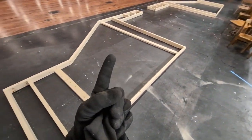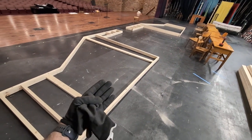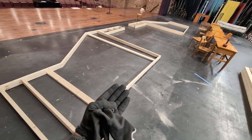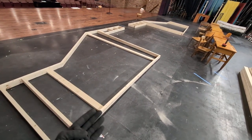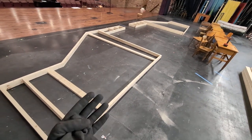The thing about it being, you want to get it up first as quick as possible, up on wheels as quick as possible. And the plywood that we use hangs long to obscure the wheels, and so it makes just a flimsy skirt across the bottom. And two things: that is insubstantial, and this whole thing won't stand up on that. And so if you put the wheels on and then get that to a point and then try to tip this thing up and the wheels are sliding all around and you're breaking the plywood, that's the wrong order.